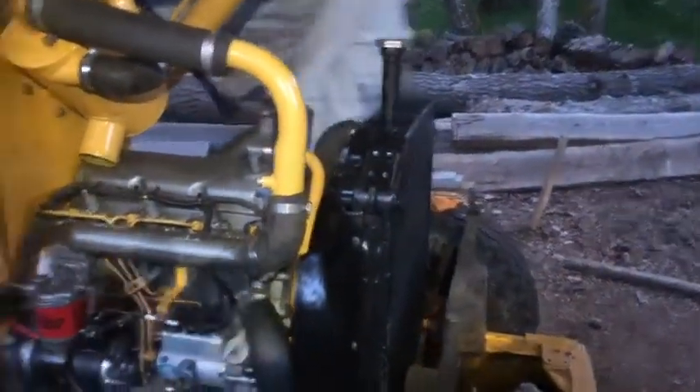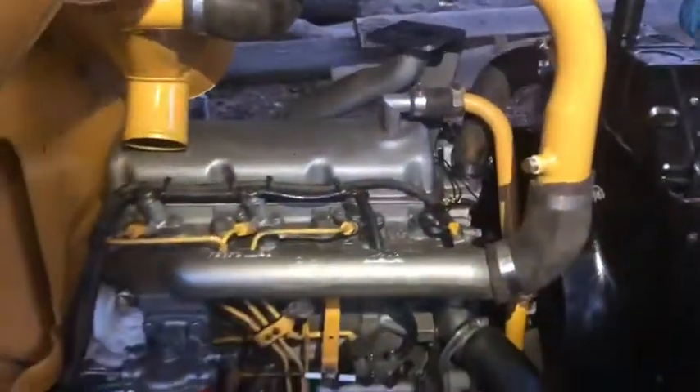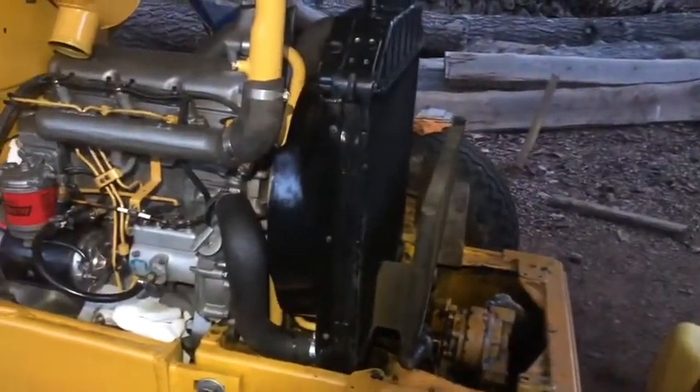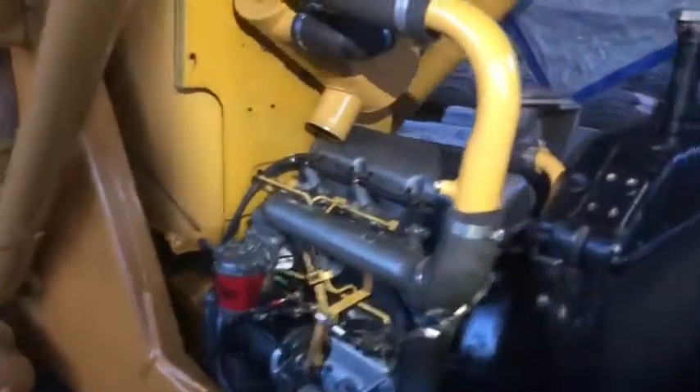So it's running. I've just been checking the fluids - got the rad fluid in and been topping it up once or twice. That's holding level and it hasn't got up to temperature yet. I'm going to go ahead now - it's built up pressure. I've got to reinstall my hydraulic pump shaft so that'll spin, put the clamshell over the top, install the hydraulic tank, and fill that. But it runs. Oh, we're dripping rad fluid out of that overflow - I'll put the cap on.